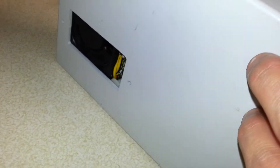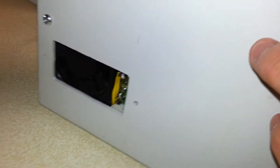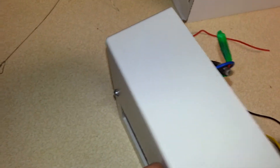It's not complete because I'm waiting on some of the sensors to get here, but what you see on this side right now is the fan — what will go there is an amp and DC meter. Basically: input AC voltage, input AC current, output DC voltage on the 12-volt rail, output 12-volt current, and 5-volt voltage and 5-volt current. That way I'll be able to see exactly how much is being drawn on the input and on each output.